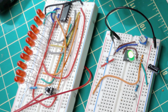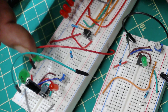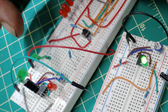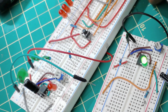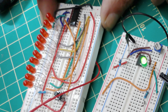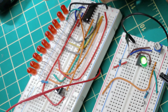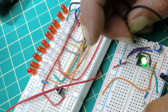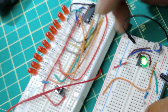I've spent hours and hours on this chaser circuit, switching components out. You can see I have resistors marked here so I know which ones I've already replaced. I've replaced capacitors, replaced pots, replaced the 4017 IC — and this circuit will not work for more than three to five seconds without this capacitor.